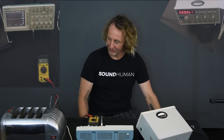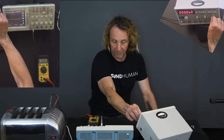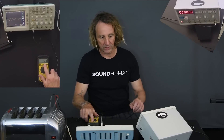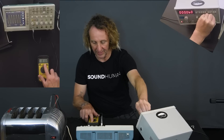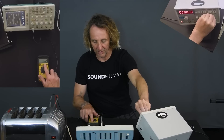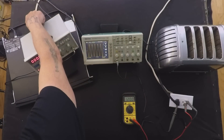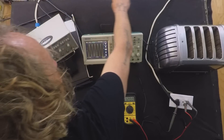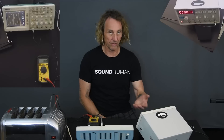So let's see if this toasts. The oscillator's on, amp is on, everything's on. So I should be able to bring this up — I see my sine wave there and my voltage there. 25 volts... 53, 69, 95, 102, 121 volts. What I forgot to mention is the NL4 to Romex adapter that I've got running, powering this duplex outlet that I've got the toaster plugged into, as well as the meter probes — which could come in handy. I can now power numerous household appliances off of this power amp, should I choose to.